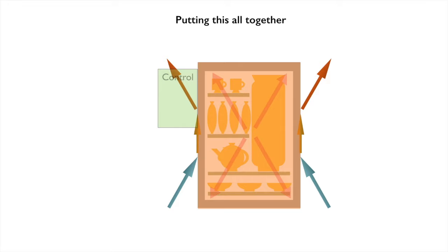Sometimes we gotta speed this process up a little bit because we want to cool it off faster. And a lot of people have cracked the kiln open to speed that up. I have. This is actually bad for your kiln because you are thermal shocking the brick. Whenever you crack that thing open, you hear the little crack, crack, crack, crack, right? That's your lid doing nasty things, and you're gonna wear it out faster.